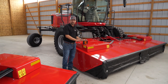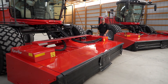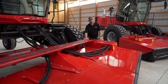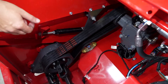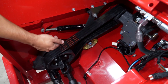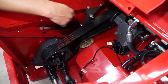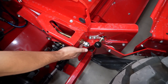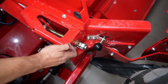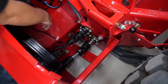Now that we've shown you the adjustments on the 16-foot version of the 9300 series, we're going to step over to the 13-foot version. The one we have here is a single conditioner, and we're going to show you the differences of the 13-foot versus the 16-foot. On the 13-foot version, the catwalk is up here on top. Compared to the 16-foot, the belt tensioning system is much simpler — this is a single conditioner versus the double conditioner TwinMax. All you have to do is adjust this one bolt and spring for your belt tension. This does not have a separate cage drive. On the 13-foot version, your roll gap is controlled by this bar here. Take the lock nut off — each revolution of this nut is one sixteenth of an inch. To go to factory settings of one eighth of an inch, you would make two full revolutions. Also, there are no skid shoes on the 13-foot.